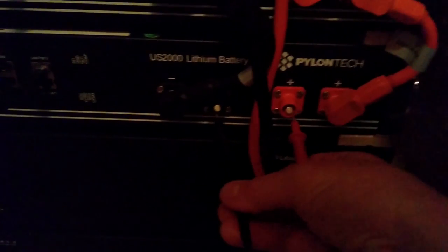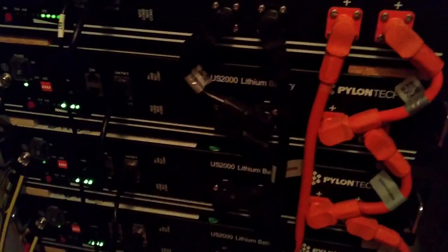Okay, so I've been using the oven and charging the car and using the washing machine to try and discharge my house batteries down to about the same level. So what I'm looking for is about 49.4. So let's just have a look and see what it is. And it says, get wires to connect. Look at that, 49.3, so bang on. So it's ready for me to take these apart, move them out of the way, put the new one at the bottom, and then restack it all up.